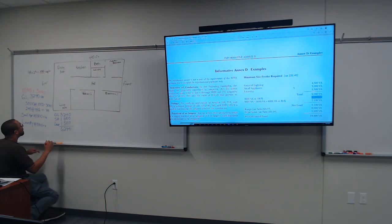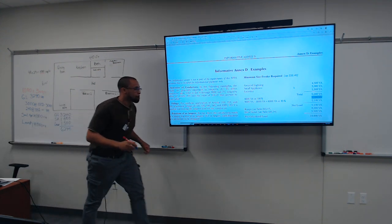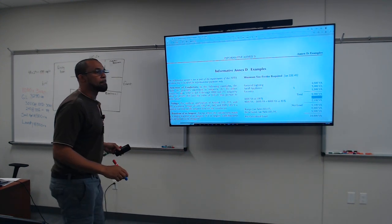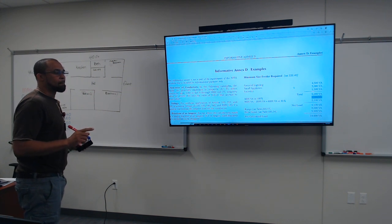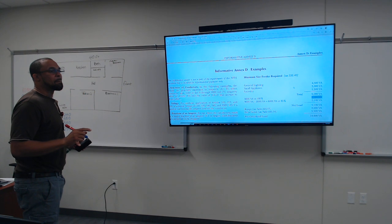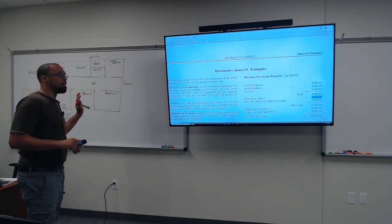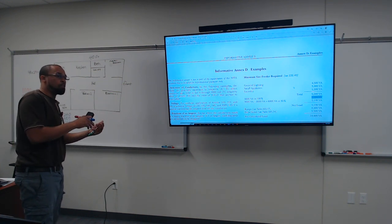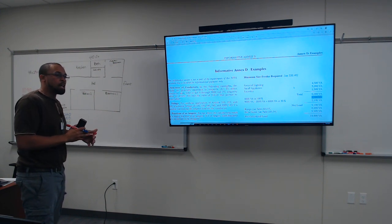Okay. All right, so I got another question. Yeah, go ahead. So, in 220.52, it says in each dwelling unit, the load shall be calculated at 1,500 volt-amperes for each 2-wire small appliance branch circuit. So are we just saying that in this we have a washing machine? No, the washing machine, that's gonna be inside the laundry. So the reason why the laundry has to be a 12 gauge 20 amp is because it's serving a washing machine, which is a small appliance motor. It has to be bigger.